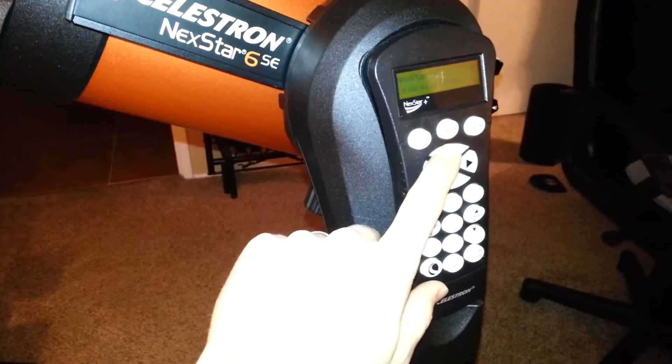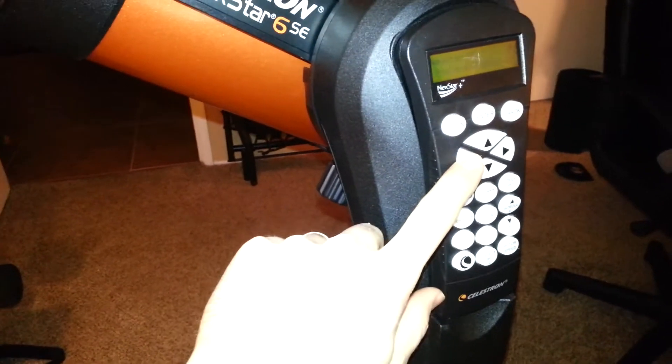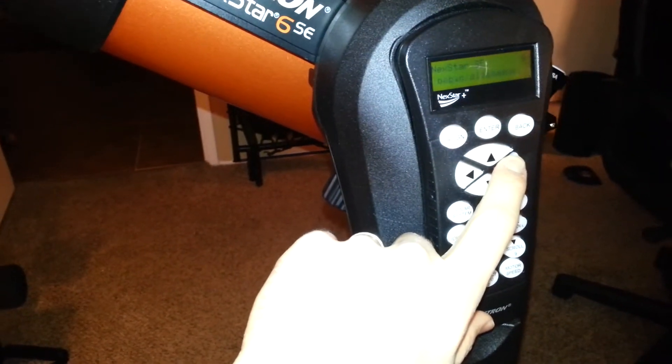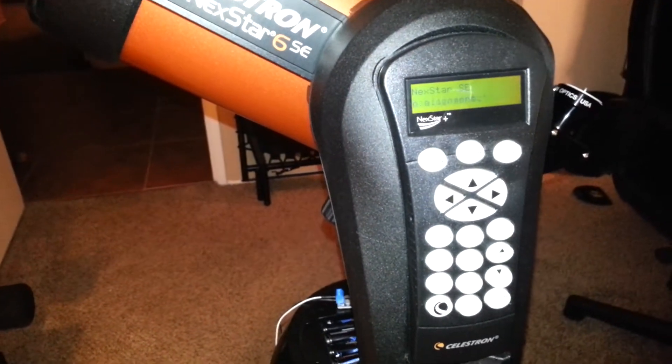It's moving, it's doing okay, but it is certainly not running at its full capacity. In fact, if I were to get a multimeter and check the battery pack, it would be running at about 10 volts right now — so we're about 2 volts under the ideal. With the mount still on, I'm just going to plug in the barrel connector here, and now we're going to start using the boost converter.